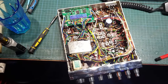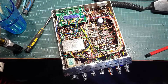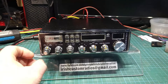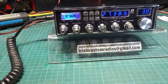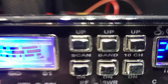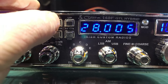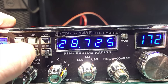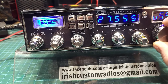We'll carry on, put the lid back on, and I just want to clean the rotary controls while I have it open. Then I'll put the lid back on and put it on the stand to show you all the features. Right, she's back together, gave it a bit of a clean as well. Turning it on — this is on 385. You've got your six buttons here so you can go up ten channels or down ten channels, you can go up a band at a time, which is like 50 channels, and you can go back down. It goes well up into 10 meters. We'll put it back on 55, which is the triple five.